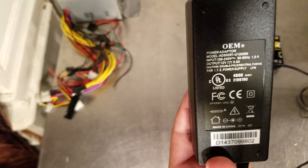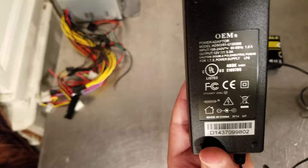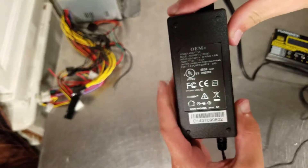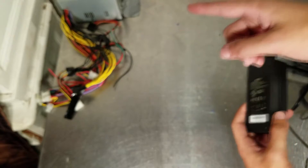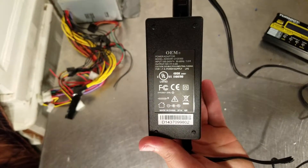What you're actually looking for is within the 11 to 18 volt range, you want up to 10 amps, because as you can see on the front right here, it says 10 amps. Using this adapter you'll charge about 70% slower, but it will get the job done. Unless you have a power supply — check out my other video — which actually outputs 10 amps so you can get the full use out of this AccuCell. Once you find all those specs, you can move on to the next part.